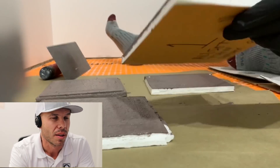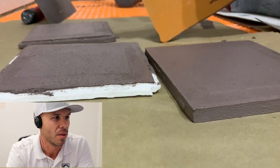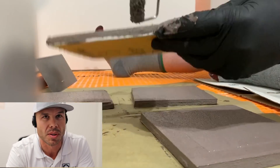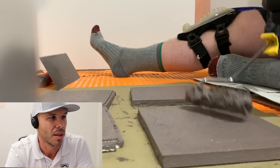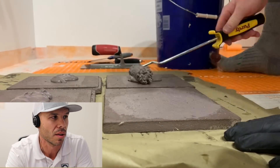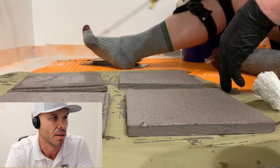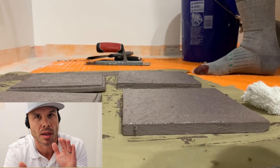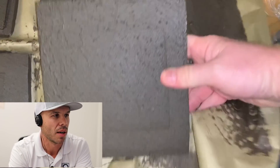The fleece on the KERDI is what allows sealants to travel under it. A lot of people think that you can just seal up one small part of KERDI, but it doesn't work that way. I see this done a lot on Instagram. You're not creating a tight seal if you're putting any kind of sealant over a polyethylene fleece membrane — it's that fleece that allows water to travel underneath the sealant. The fleece is needed because that's the mechanical property that allows thinset to bond to it well.